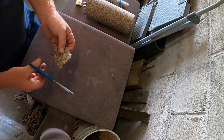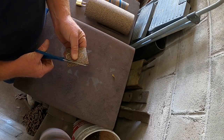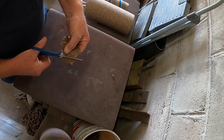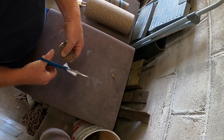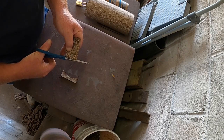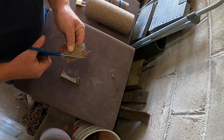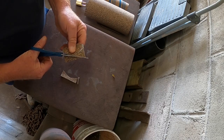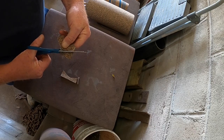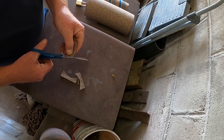Like I said, I'm not sure that this is what is wrong with the Cub, but I'm no expert, and I think with the way these carburetors work, if it was sucking any air there, it wasn't getting up, because it never smelled flooded. It was just like it wasn't getting enough gas at all, even with a choke. So I'm thinking that due to that little bit of warpage that the carburetor top has, and maybe that one bolt I put in the side may have made it worse, if you will. So we're going to try this and see. I got plenty of gasket material here, and I think this thicker material will help take up what little bit of out of plane the top of the carburetor is.